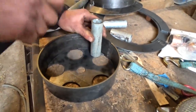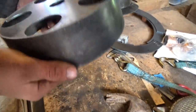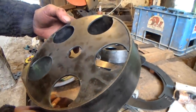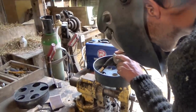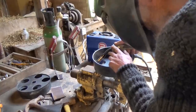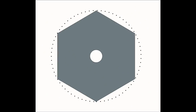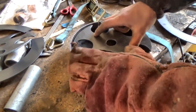Now of course there are two different sized discs for the inserts. I had to experiment to get these to fit where I wanted them, since the theoretical size of a piece cut on the plasma cutter may differ slightly from the real life size. By the way, I was asked how you could possibly cut a circle out with an angle grinder — well, I say don't bother. Just go with something simple like a hexagon or a pentagon and weld the corners.